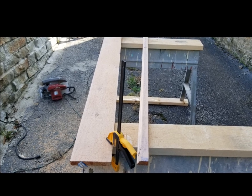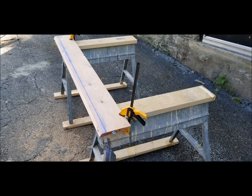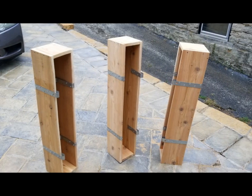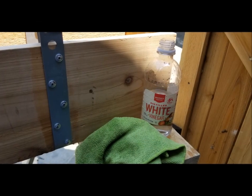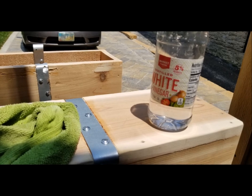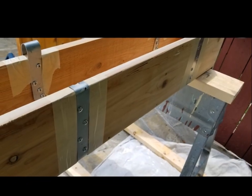Ripping the wood — and again clamping it in place, working by myself. This is a good way to do it: you can route it, rip a piece off, route the other end, rip it off, and you're not having to work with a really skinny piece of wood. There are the boxes with the steel bands on them, ready to go with a little more touch-up work. This is white vinegar — when you have galvanized steel like these bands, my dad told me years ago when he was a painter that white vinegar makes it so the paint sticks to the galvanized.